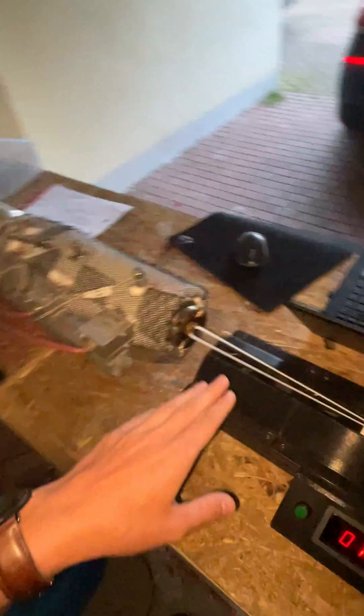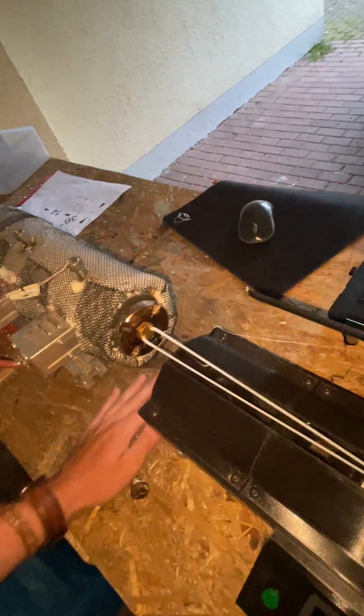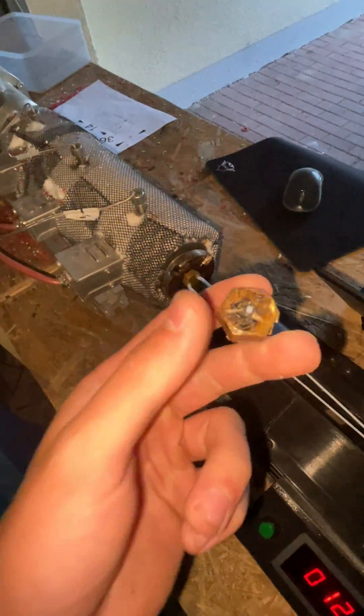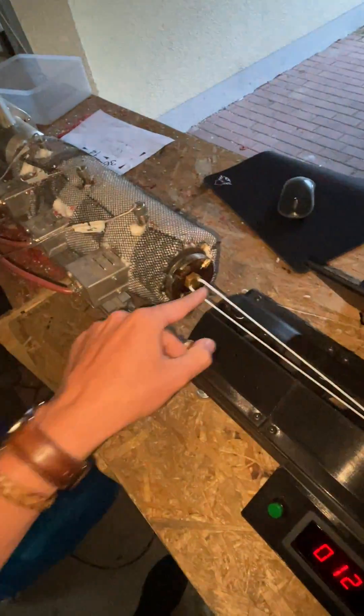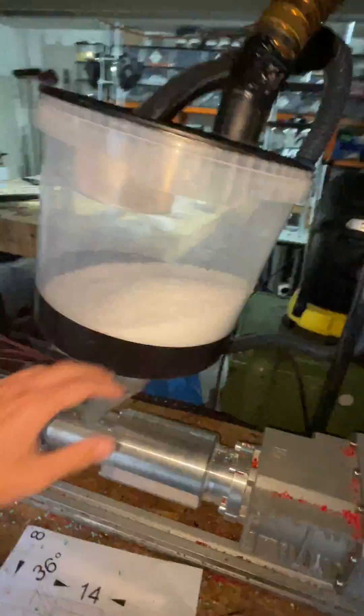The airpacks are only at 20% — they have much more power. The special thing is that we've now divided the nozzle: where it used to have only one outlet, we now have two. Therefore we get two filament strings that we can pull over to our winders.